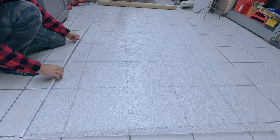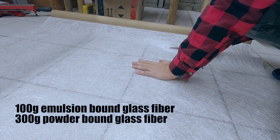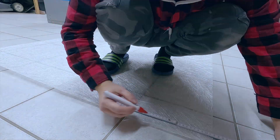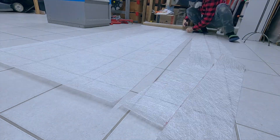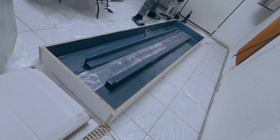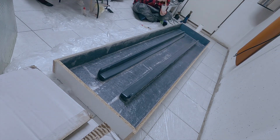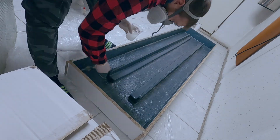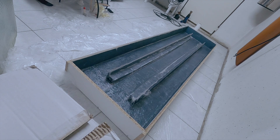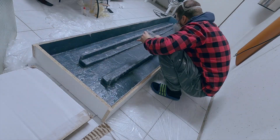I got myself a couple of rolls of two different weight chopped strand glass fiber mats — one roll was 100 grams emulsion bound and the other was 300 grams powder bound. I measured everything out and pre-cut just about everything apart from the last coat. The first glass fiber coat after the gel coat is always a coupling coat. It requires a light easy-to-consolidate sheet so you can press out all the air bubbles with your brush or roller, ensuring the hard gel coat has solid reinforcement. The 100 gram emulsion bound glass fiber worked like a charm — the emulsion dissolves after soaking with epoxy, making it super pliable and easy to remove air from underneath.